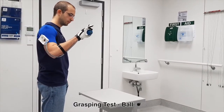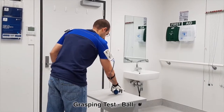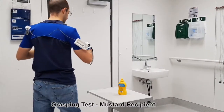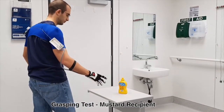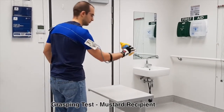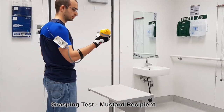The device consists of four different parts: the differential module, the soft glove, the tendon tensioning and adjustment mechanism, and the harness. The body-powered mechanism allows the transmission of forces from the upper body, like the shoulders, to the index, middle and thumb fingers through the tendon routing system. Simple body movements can increase the tension of the tendon, actuating the soft exoskeleton glove.